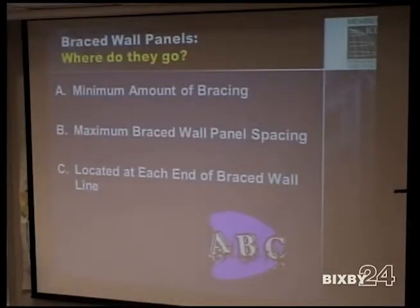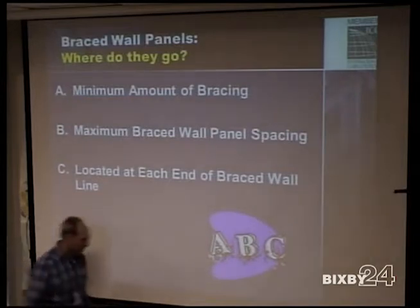I think it says in the code also, maximum header length is 22 feet. I think that only shows that for the CSPF method. I don't know if it's for the others or not, but it specifically says it at the CSPF method that your header can only be 22 feet long. If we have over 22 feet, then we need to go to the previous method. Well, no, again, it only shows it in, I think... Let's say you have a wider garage span,